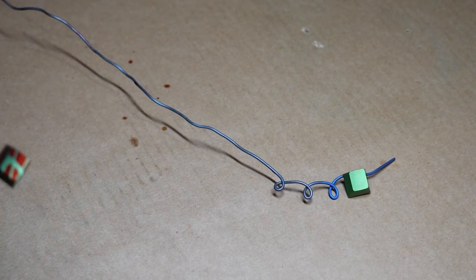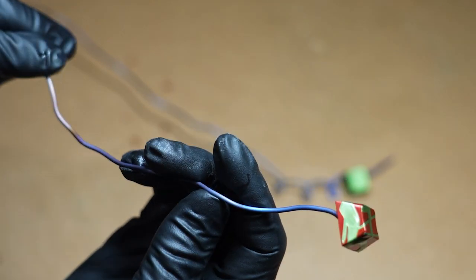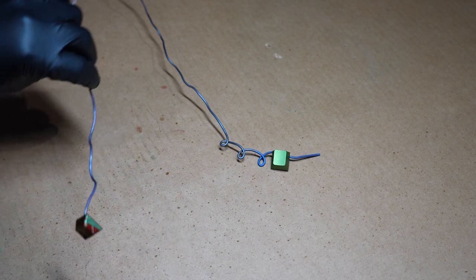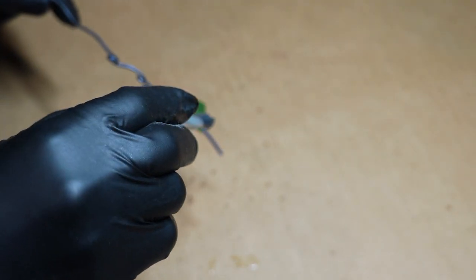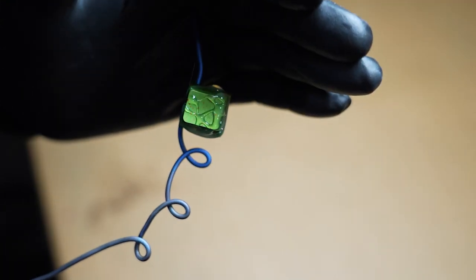I have added the reverse colors. Look at that red and that green — absolutely stunning. Adding flakes, turning around and doing it to this side as well. So what I'll probably do with these keycaps is go ahead and run them to the sealer, where the pores are now going to be shut closed, trapping the dye inside. That way you can keep all the color that you've added to the aluminum piece. I'm going to wait for those to seal, put them on the table, take a good look at them, and then take an awesome thumbnail photo.